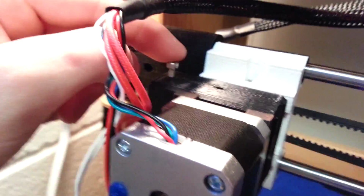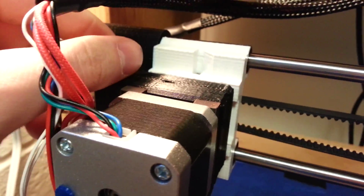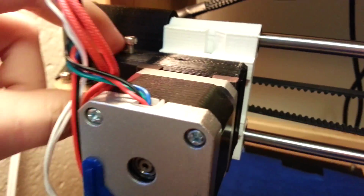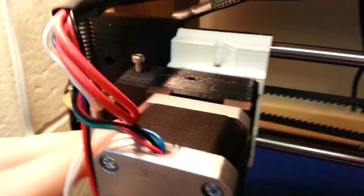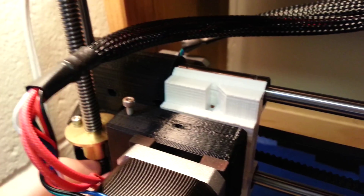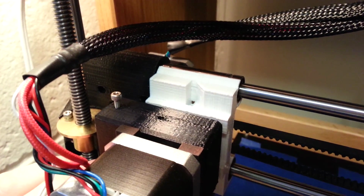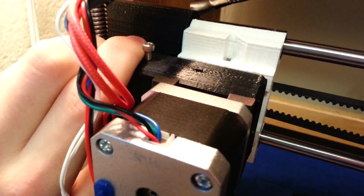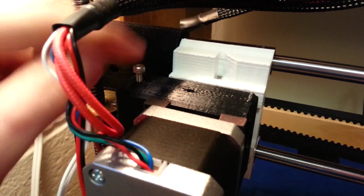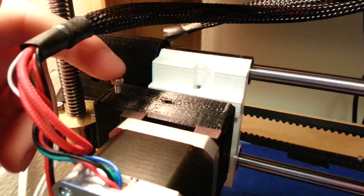But as you can see, you can tension it with this, make it tighter or looser, and it doesn't change a thing other than the maximum amount of tension that goes on this lever arm, which is really nice because, well, first of all, it's a lot easier to adjust, whereas the other lever design did have an adjustable tension, but you had to take it apart and put in physical spacers. So this, I find, is obviously much easier because you can just tighten the screw. Although it does require extra hardware, but, you know, not a big deal.